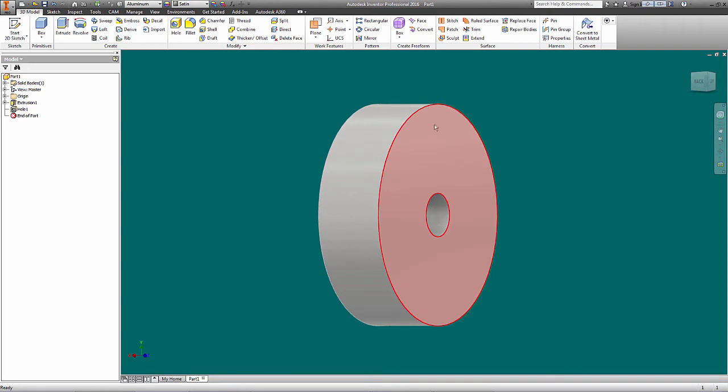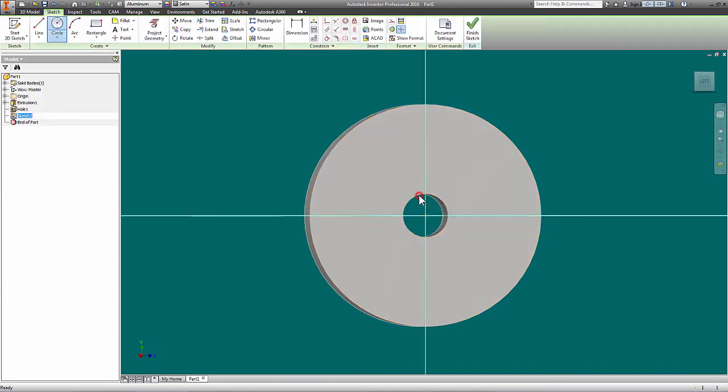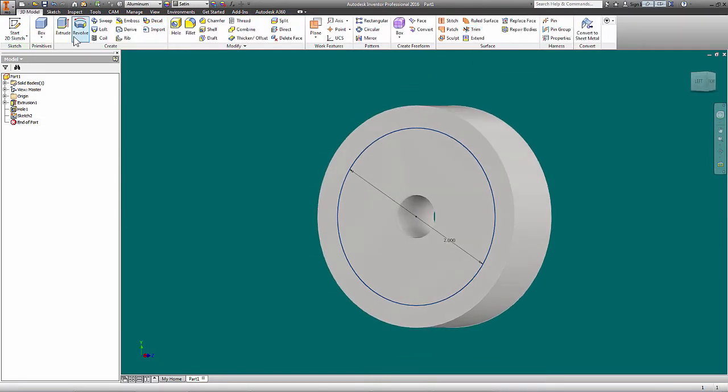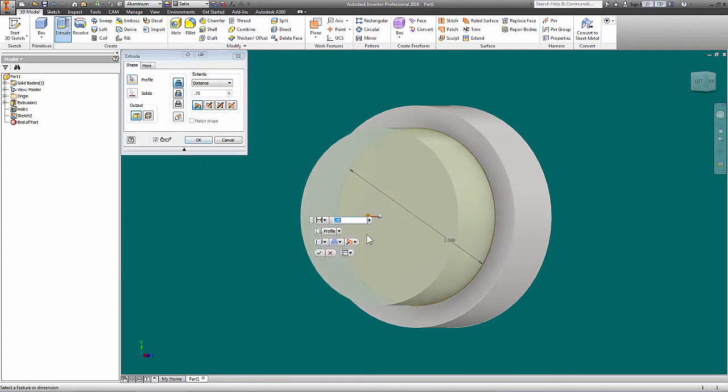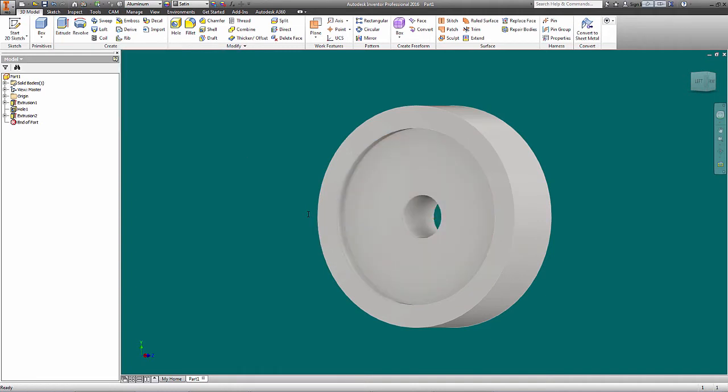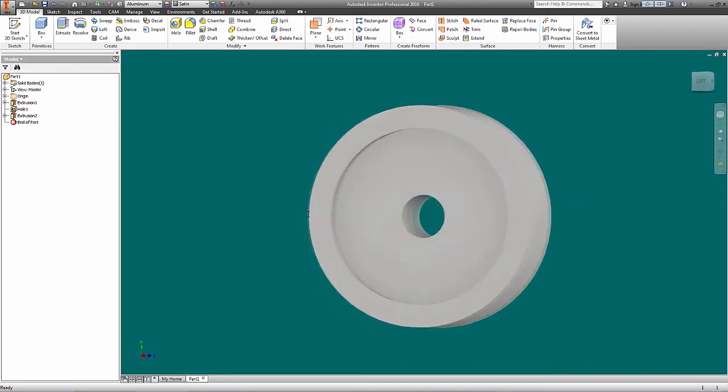I want to dish this out because I only want it gripping the grinding wheel along the outside edge, and I may have an extended hub on the wheel, so I want to get rid of some of that material. No problem — let's do another sketch right off that face, take a circle, make it two inches, and I'm going to extrude that going backwards — cut the material out. It only needs to be about one-eighth of an inch, so one-slash-eight. There we go — a nice little pocket.